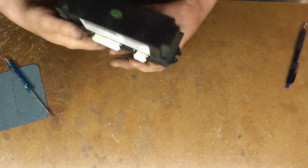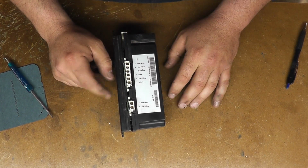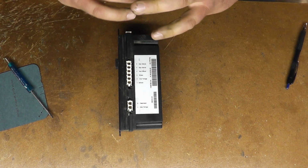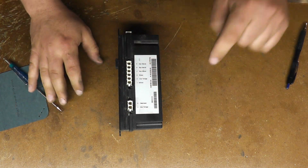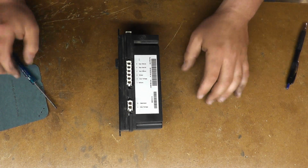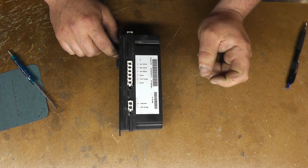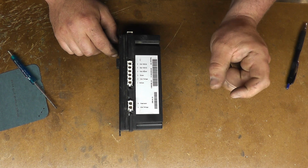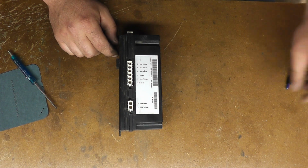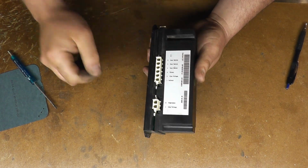Now here's what will happen. You get the call that the freezer or cooler isn't working. You go there and you open up the evaporator coil, and the thing is an absolute block of ice. You can manually set the unit into defrost with the keypad, and the little melty snowflake icon pops up on the display, but your compressor's still running. Well, you get the Fonzie method and go in the back of the unit and whack this. Just give it a good whack, and guess what'll happen?